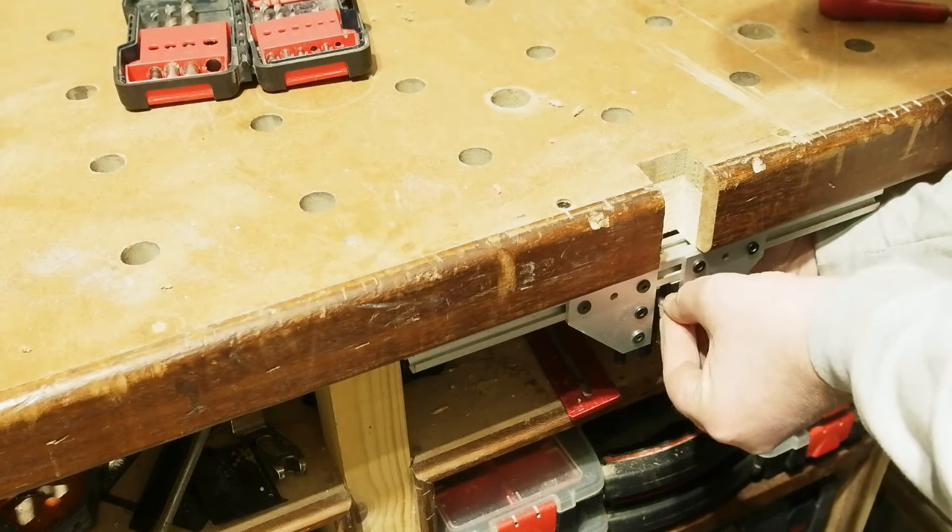By this time my self-adhesive metal tape had arrived. Because I have a left and right fence, I bought the two-metre zero-in-the-middle version. I had a bit of a dilemma about where to put it — I wanted both the front and the top slot in the black fence part open, and sticking it on the silver bit of profile was pointless as it's too far away from the flip stops. I considered bending the tape over the corner, but this tape — which I assumed would be more like a heavy duty foil — is super stiff and there's no chance it'll fold. The only reason I wanted the front slot open was to fit my angle majig, which has sliding T-nuts on the rear to attach to the fence. I could however make top plates to attach it instead, which I ended up doing.